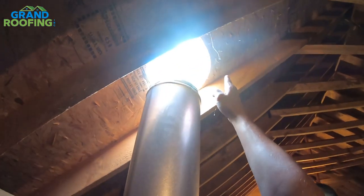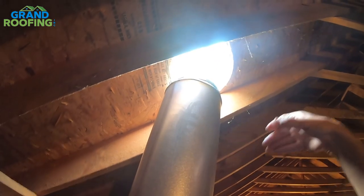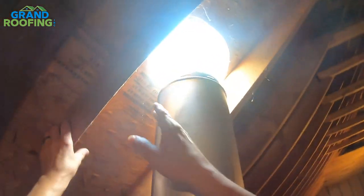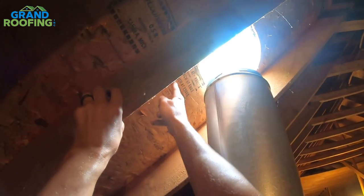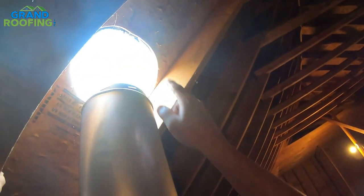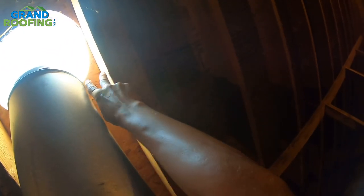I need to go a little bit lower on this roof side, possibly a little bit higher — as I said, the steeper the pitch, the more of an egg shape it's got to be. You want clearances not only from your trusses and rafters, but also your decking. I believe it's two inches off of the truss here, so we're good right there. I'll grab the other pipe on the way up and be right back on the roof side.